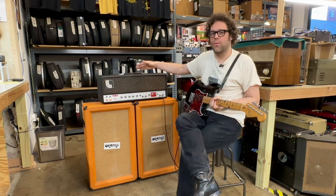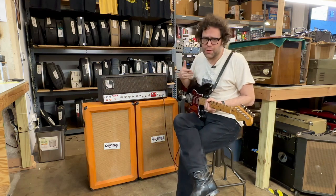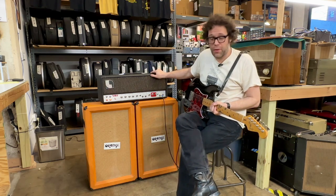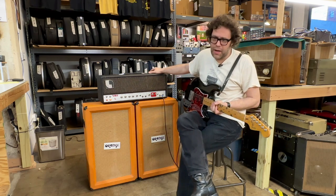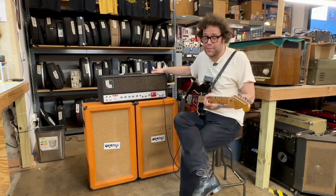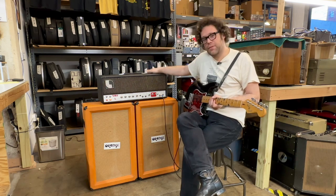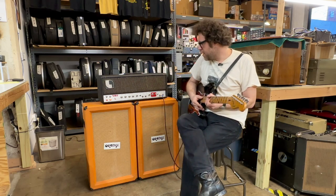First, let's address the tube-eating issue. In New York City we have 125 volts AC out of the wall, which was giving us 599 volts on the plate. The customer runs his amps on a variac, so we're now running this at 115 volts and I've biased it for 115. I also lowered the screen voltage on the EL34 power tubes, increased the filtration — the amp had almost no filtration and no choke — increased the screen resistors, and we're running on the variac. It's running a lot smoother and we're not getting that weird distortion. The impedance selector was also cutting out, and I did some other servicing. It sounded pretty awesome.